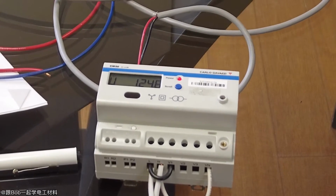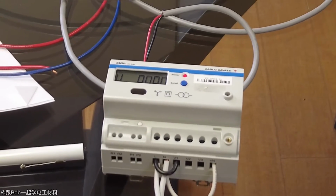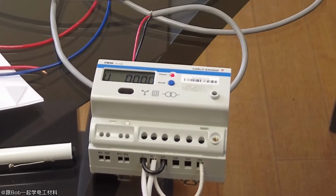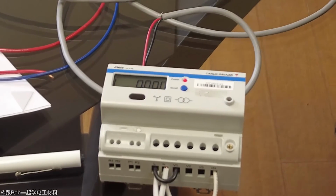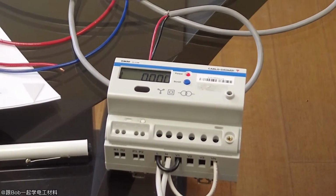We're not going to generate the bill. We're just going to tell you your consumption. So I think you'll agree this is an easier way to do it, especially if you're making a lot of them. It's quite doable with this, because you're only going to change the CT ratio, the Modbus address, and the system type in almost every system you ever do.